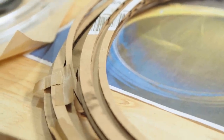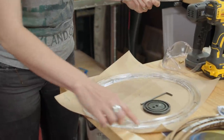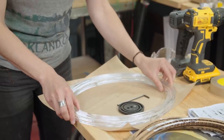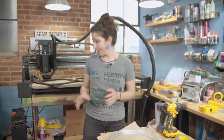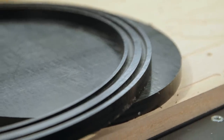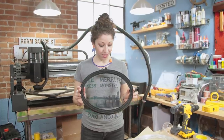This is the first functional prototype with the magnets. So there's a neck ring with channels for both visors, and then there's a receiving piece that will accept this on the spacesuit. That way Adam can get in and out of the suit with ease. From the acrylic versions, we did plywood, we did Delrin, and we finally ended up at this. This is the final version that we ended up with. Test fit it this morning, today, and it works. It remarkably somehow fits. So I'm going to hand this off to Adam so he can start attaching things.